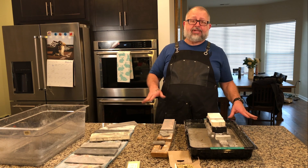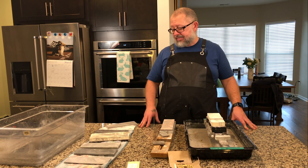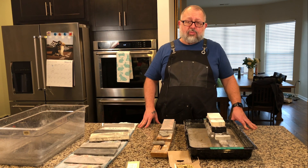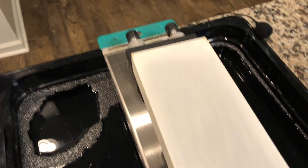You definitely need to use the right tool for the job. This was just a quick tip on maintaining your equipment and not contaminating particles into your stones. Definitely go for the Atoma if you need to flatten the stones — we do need to do that every once in a while. Try to clean your stones at the end of every use. Let them set up and dry on their own. If they're stored in a box, don't put them back immediately — you need that water to evaporate and let the stone dry out and breathe. There are certain stones, very specific ones, that you can soak forever and they live in water. Nothing wrong with that if you have those stones. Life gets in the way — I just wanted to bring you these quick tips on maintaining your equipment so you have it for a long time.